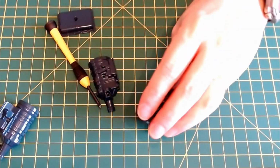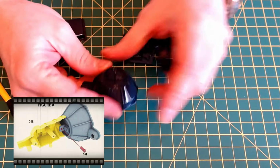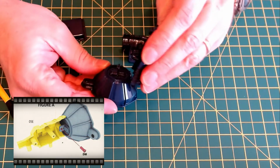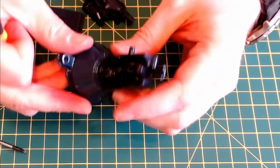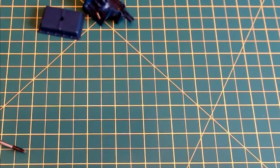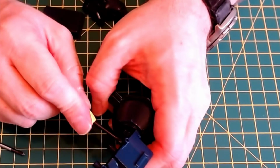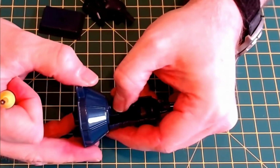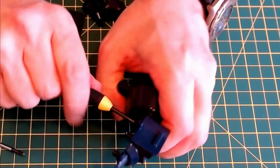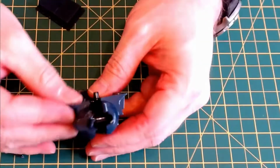Okay. Now it's putting the housing of the gearbox on, pointing to my right. The sump part, the oil pan, goes into there, and then we connect that up with a DM screw. That was tough to go in. It's still not 100% secure. So yeah, that's now secured, but wow, that was quite tough. I actually took the gearbox off, cut the thread without it being on the bell housing, and then put it in afterwards. That was pretty tough to get in, don't mind saying.